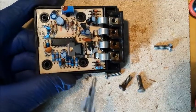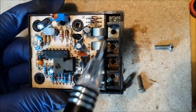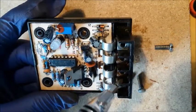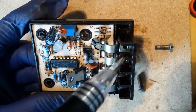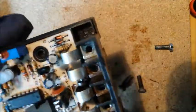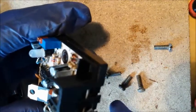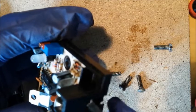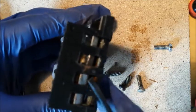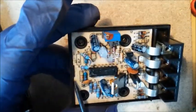If you look at these posts which are embedded in the plastic, they're held in with little tabs here. What we need to do is lever these out with a screwdriver so that we can push them up and get these connector wires out from this side of the device, rather than trying to lever the board out directly.